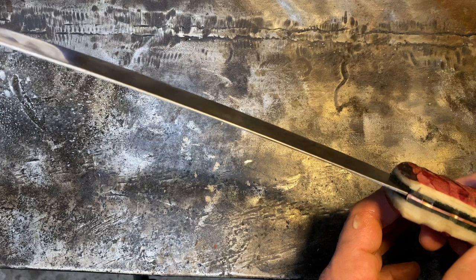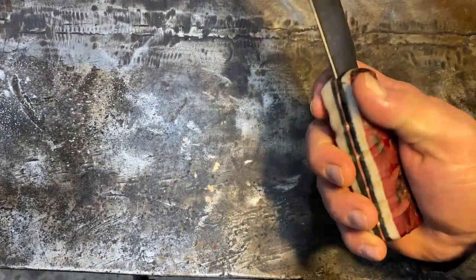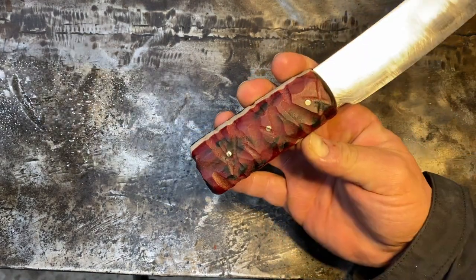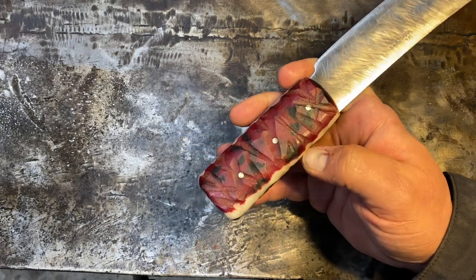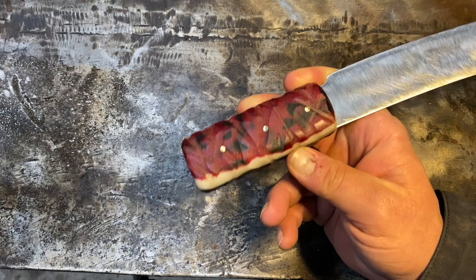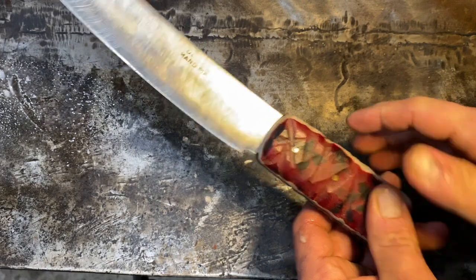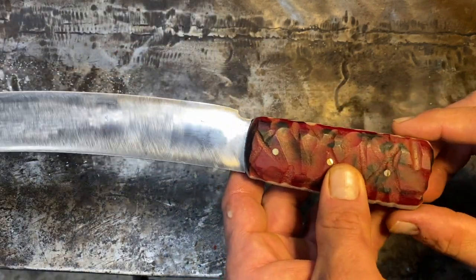Another thing that I learned in making this knife was about handle making and some liner making. I'll never use white micarta for anything again. I do like this rock pattern. I definitely don't think that I've got anywhere near the cool factor on my rock pattern that Simple Little Life Jeremy does at Homestead Knives, but I think I got something there. As far as the finish, I also probably will never use terry cloth again to make micarta. It's just too difficult to finish.